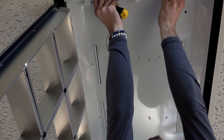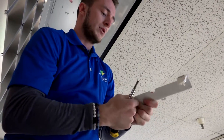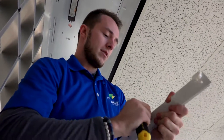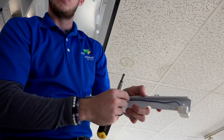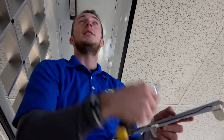So what you're going to want to do is take out these old tombstones, replace them with new tombstones, and then piggyback each one to each other. One of the tombstones you're going to have wires running out of. Your red is going to go to your red and your blue is going to go to your white to provide the power since we bypassed the ballast.